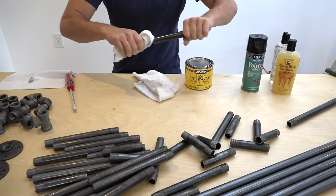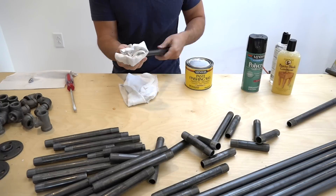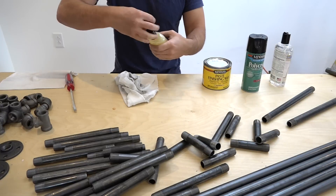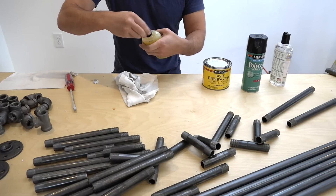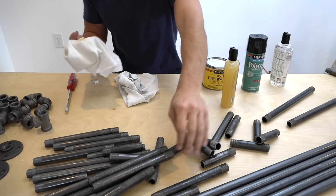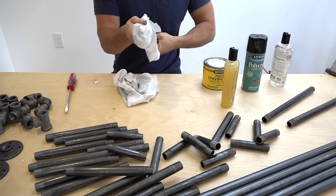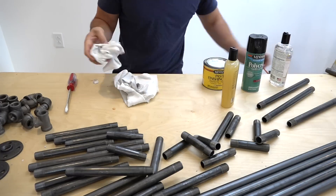I've also had reasonably good success using mineral oil. I actually used a cutting board oil meant for conditioning cutting boards and just wiped that onto the pipes. It doesn't come out as dry as the paste wax — there's still a little bit of an oily residue you can barely feel with your finger, and it takes a while to completely dry. But it's much easier to apply than paste wax and doesn't gunk up as much around the edges of the pipe fittings. There's also a version of cutting board conditioner with some wax mixed in, which protects a little better than just mineral oil by itself, though it has a bit more waxy residue.